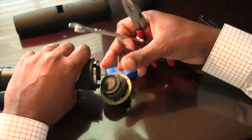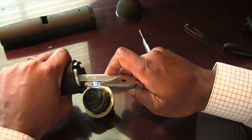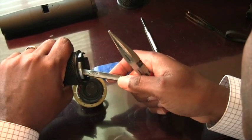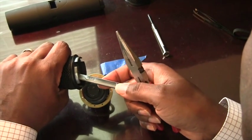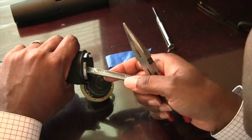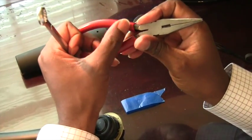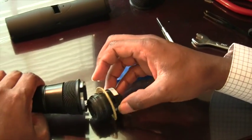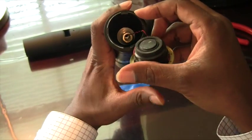You're taking off this bolt — it's very tight. You'll have to use the handle of your pliers to go through the end of your wrench and twist. That's the only way to get the right kind of force without damaging any other parts of the microphone. It's very, very tight. I had to go off camera to get my nerves together. You can see it get loose — you'll feel it very loose — and then you can get your finger in and feel it come off. The whole thing is off now.